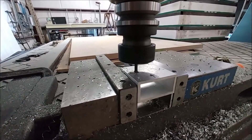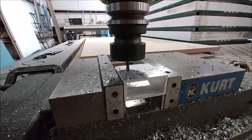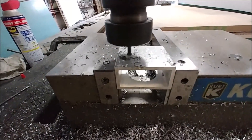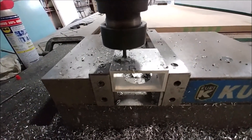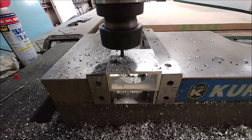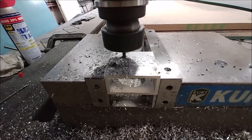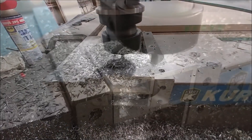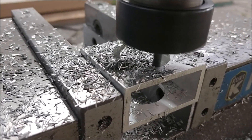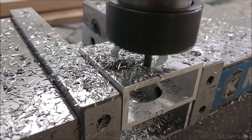While that's running, someone had asked about whether everything up front in the cabin could be made modular — and yes, the plan is to do that. So rather than putting so many hard points in the forward bulkhead, we'd have a full assembly of the dash, side sticks, and rudder pedals assembled outside, then the whole thing slid in and bolted in with maybe four bolts. That's something we can do for production to speed things along and reduce manual layup of hard points.